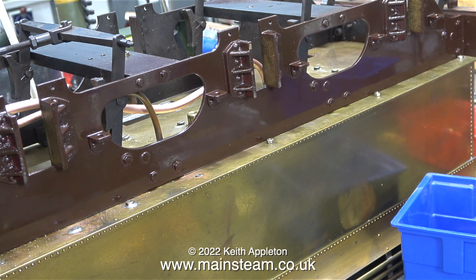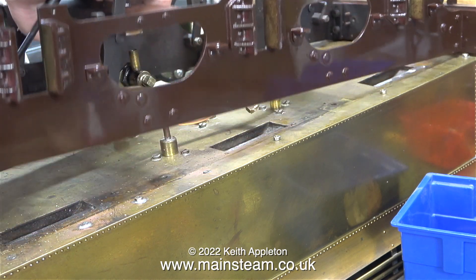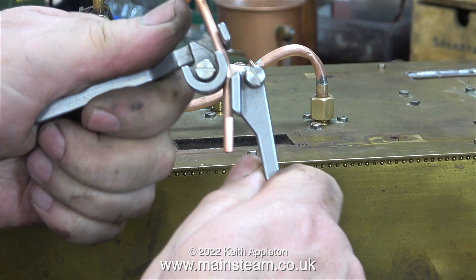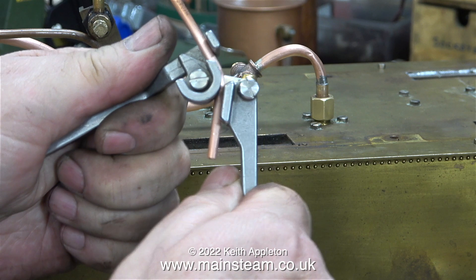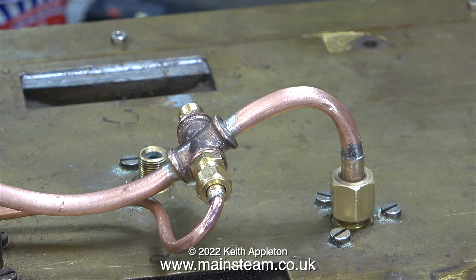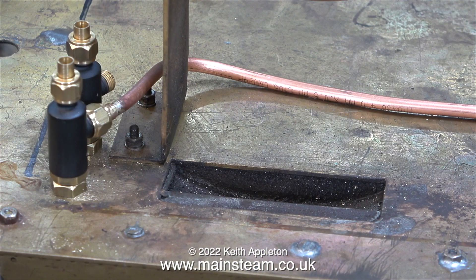Initially I've decided to fit the water valves that use 5/32 of an inch pipe, which is the correct size for the quarter by 40 unions, because the threads on the water valves are quarter by 40 with union nuts and cones for 5/32 pipe. I'm using a very small microcosm pipe bender to get some very tight bends, because the 5/32 pipe — which is actually 4 millimetre pipe — is fairly close to the wheels. Here's a clip from the water feed end, and this is a clip where the pipe fastens onto the valve body.